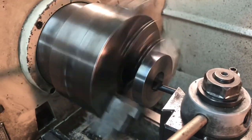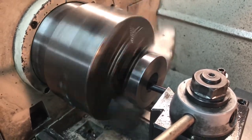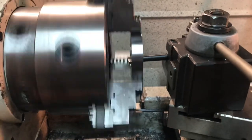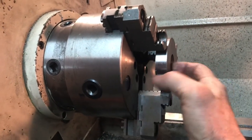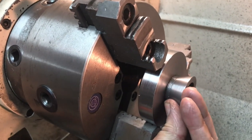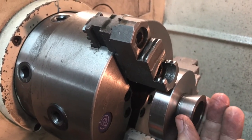The thickness I left about 30 thou - about a 32nd of an inch thick - so that when I reverse it I'll be able to take a skim off the back side. The back side now is what will be the visible side. I got this side as perfect and smooth as I possibly could. I haven't even measured this just yet but I'll try the part in - we'll see how we look. Just barely fits.